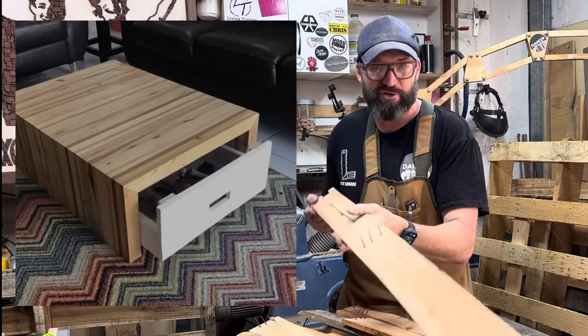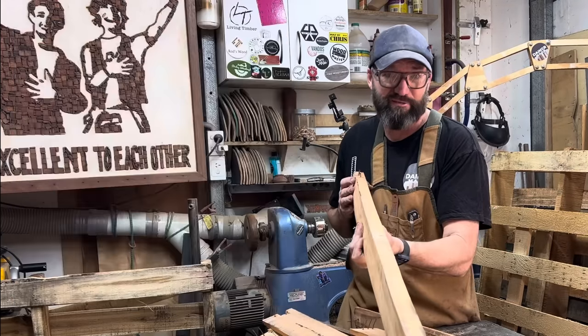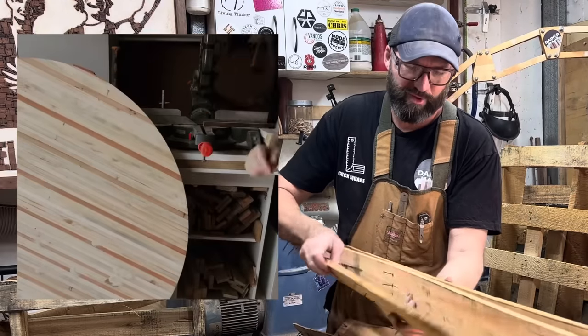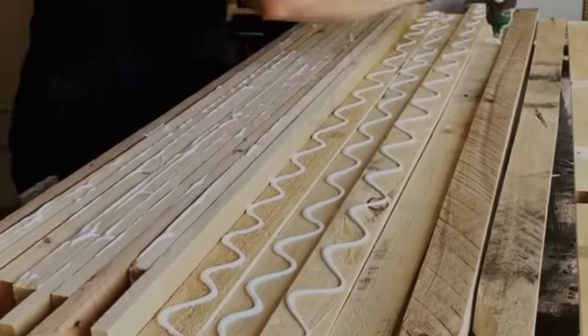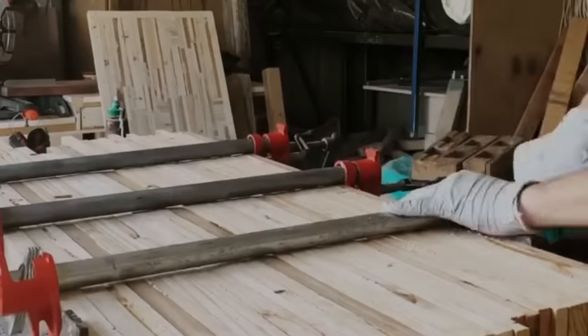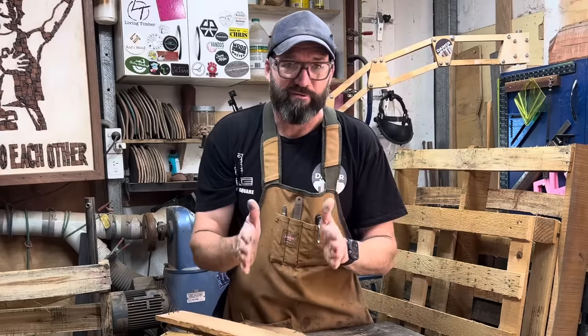A lot of thin strip palings and some thicker stretches, straight if you're lucky. Because I wanted to build a chunky workbench, I needed to join all this timber together to make up a nice chunky beam. I de-nailed, hand planed off some of the timber, glued it together with very ordinary PVA glue, clamped it up, then planed off that side and fell in love with pallet wood side-grain furniture.